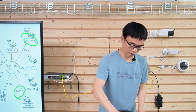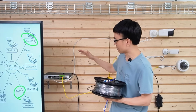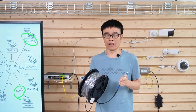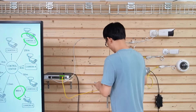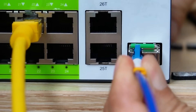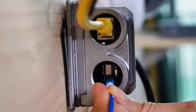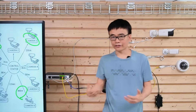There's just one last thing — the fiber optic cable. We need to pull the fiber optic cable from the PoE switch to the media converter and attach the single-mode fiber optic cable to both ends. Then go to the outdoor media converter and attach the fiber optic strand to it. That's all.